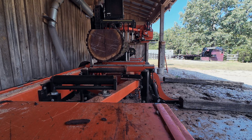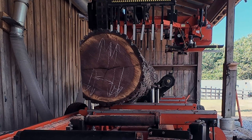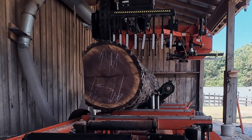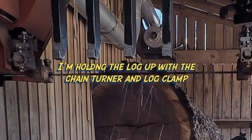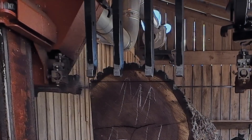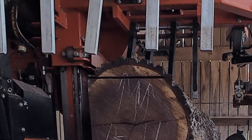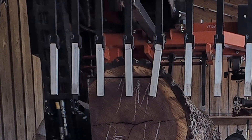Let's try and see what the other face looks like — and this time I'm going to try not to hit my camera on the drag back. Anytime you're doing high-grade sawing, I really like to do what's called parallel bark sawing, but again I'm not using my toe boards. I'm going to take another look at the stress on this face. This is an intentionally shallow cut — sapwood everywhere.